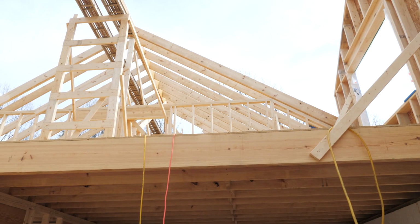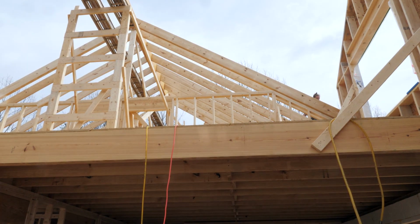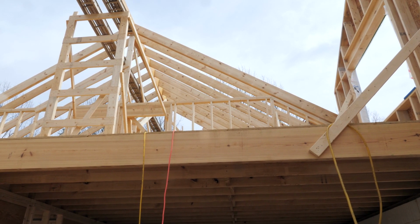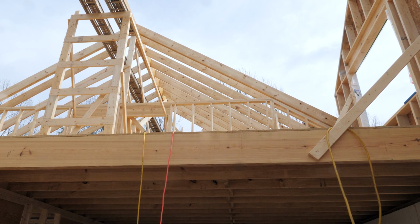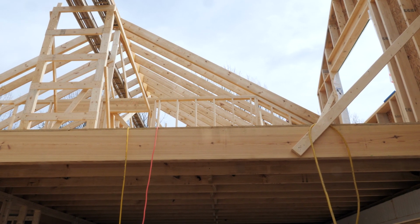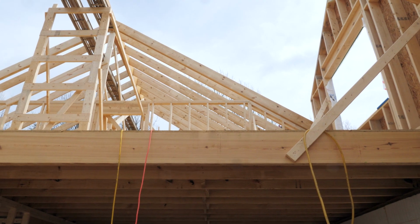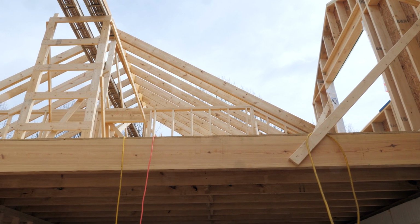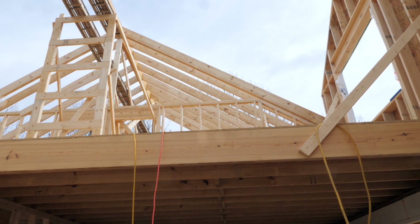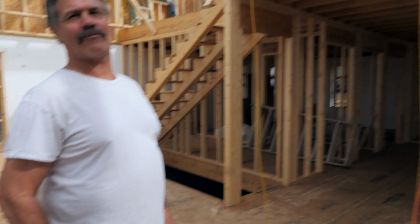And then that'll all be a wall, and there'll be conditioned attic space above those. Those are bedrooms up there. So we're going to spray foam the whole roof, making that attic space above that wall conditioned space, so we could put an air handler in there, and then you're not heating or cooling unconditioned air, and plus we'll have a little bit of storage. All right? That's right.